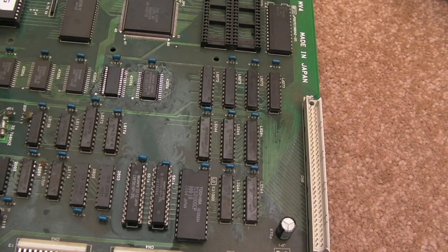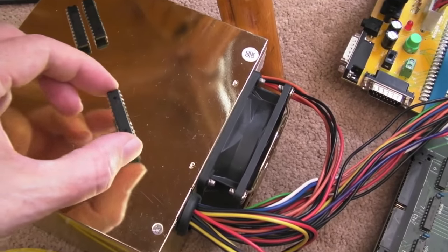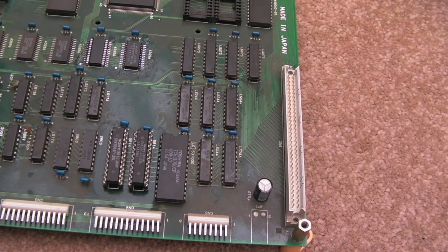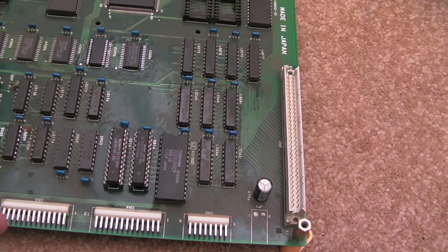Well as you might have gathered, I was a bit tired last night when I was trying to do this - I only had a couple of hours of sunlight left. So we've got the SRAMs on there now. I had some fun and games actually. The two original ones are on there and I had two replacements, but one of the replacements doesn't work - it reads but doesn't write or something like that. The other ones have got other problems too - one has issues at certain addresses and another has the inverse problem with reading. So three different SRAMs faulty there. But I've got a spare from one of my spare boards and I've ordered a replacement.